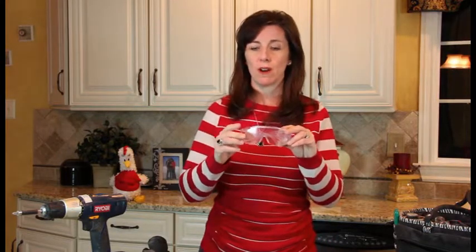The most important safety tool you will need for any DIY project that involves cutting, sanding, chopping, or any project that might have debris flying — you need safety goggles. Really great safety goggles. You want to make sure they're snug, that they come close to your face, they have a little bit of side eye protection, and they're not going to slip. When you put them on, shake your head, toss your hair a little bit, and make sure they're not going to come off in the middle of a project. Confession time: I hit 40 and my eyesight went south for near vision, so some days I have to put on my reading glasses topped by safety glasses. Do what you have to do, but keep your eyes safe.